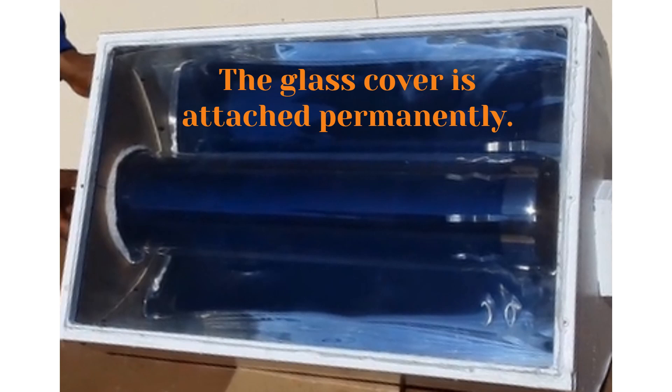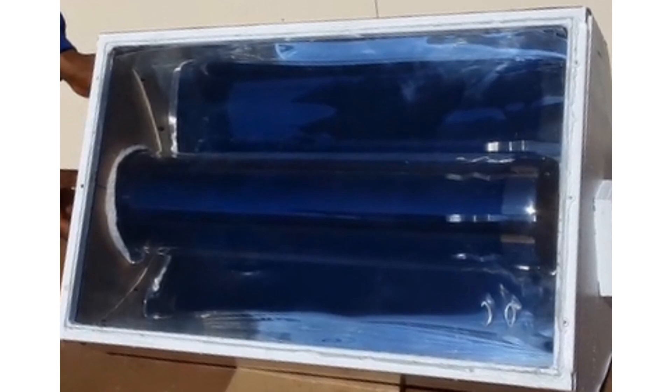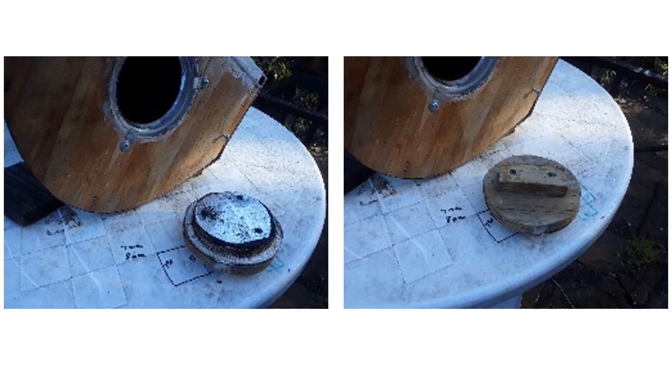Use white silicone to attach the glass to the top of the frame and allow it to dry completely. Make a lid for the tube using scraps of plywood — cut one disc the interior size of the tube and another slightly larger, then attach them with glue. Line the interior of the lid with a circular piece of aluminum and attach with screws, which will also help secure the two discs together.